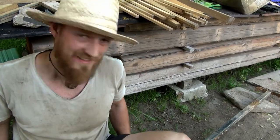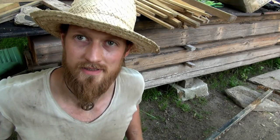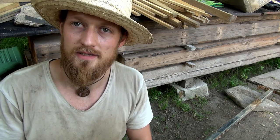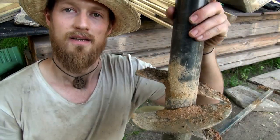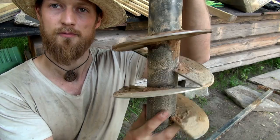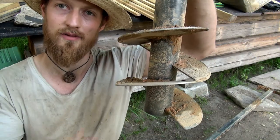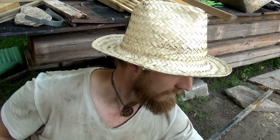So after two days of drilling I finally got some water. It doesn't look very good, but it's water nonetheless. The issue I ran into right now is that I can't use this drill anymore, because as I drill down and take the stuff from the bottom, it goes into the screw and as I try to pull it out it all slides down with the water. So this brings basically nothing out from the hole. And I still need to go deeper because there's only like 20 centimeters of water, which is not nearly enough.